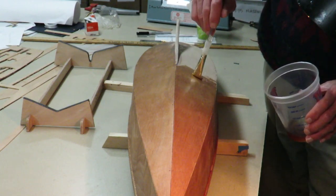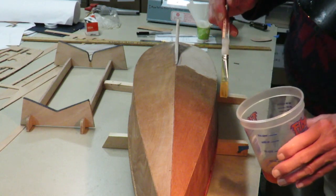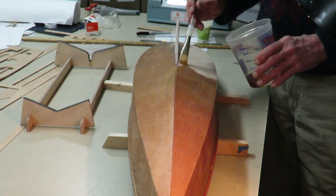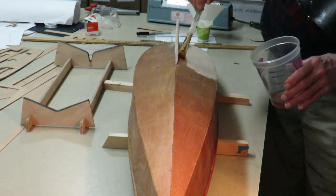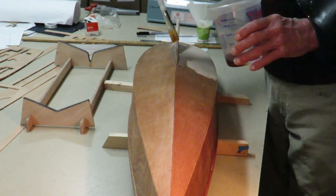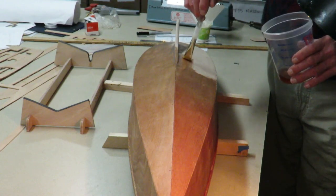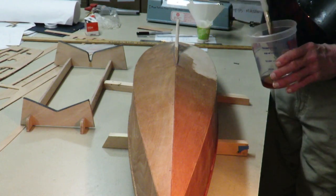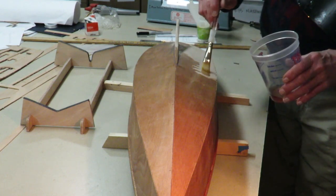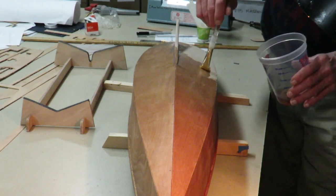So that is my inclination. And with the primer, we'll have plenty of build to have a perfect coat. I mean, you can put on five coats of primer easier than one coat of epoxy, really. Because the epoxy never goes on terribly smoothly. It isn't designed as a coating so much. If you put it on too thick, you'll get runs and sags, but you'll always get a slightly bumpy surface. So it does require more sanding.